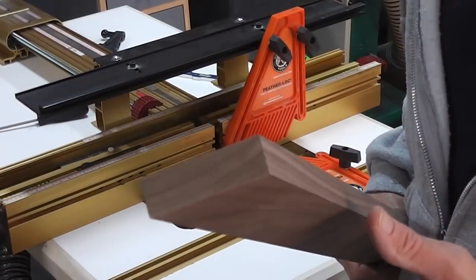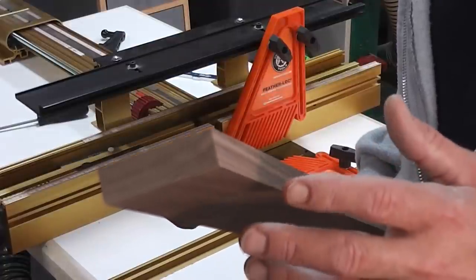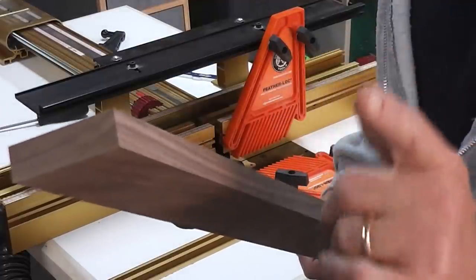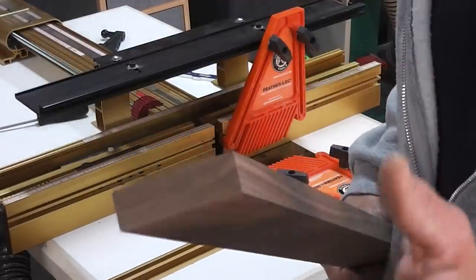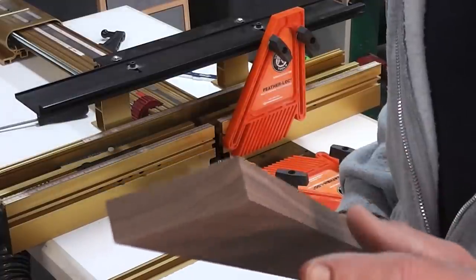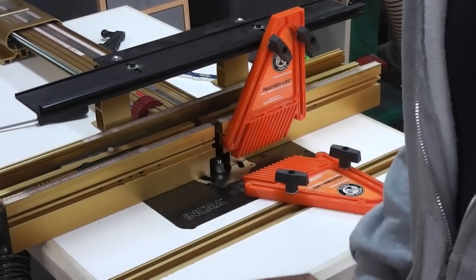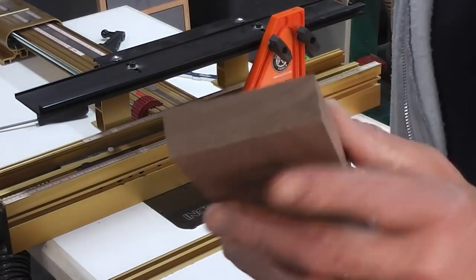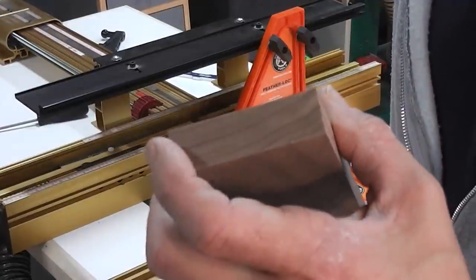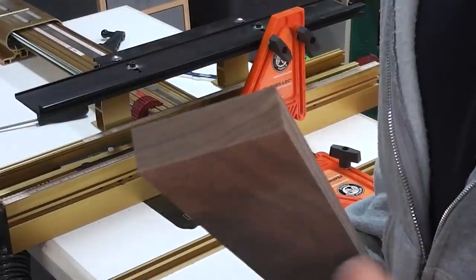There's going to be four pieces cut at a 45-degree angle, three-eighths of an inch, and they're going to go around between the field and the side I've just cut. I found the easiest way to cut these 45-degree chamfers, especially on something this size, is to do it at the router table with the chamfer bit. So what I'm going to do is cut one 45 here and one 45 here, cut these off, and then repeat it again on a larger piece. I need four pieces of this.